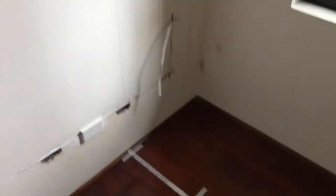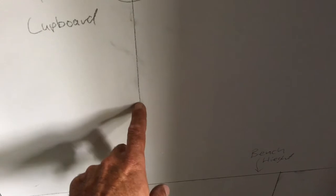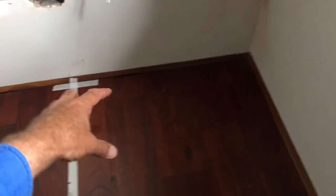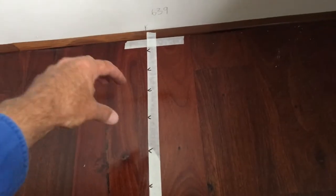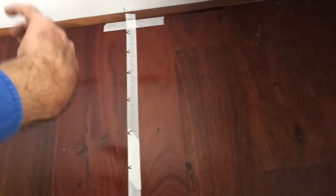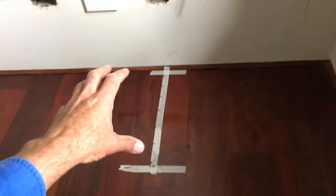So I've just marked out roughly where everything is going. This is the edge of the trough cabinet — it's going to sit in there. I've got the center of the trough marked on the wall and the center of the cupboard. So if they put the tap in here, the outlet will be up here somewhere. What I want to do is drill a large hole here all the way through the concrete, and then another hole here just enough for the floor waste, so I can work through the big hole and get that floor waste in position — and that will sit underneath the washing machine that's going to go here.